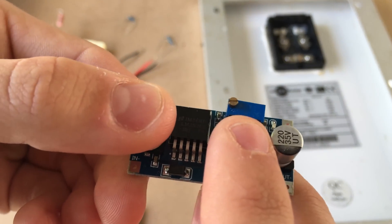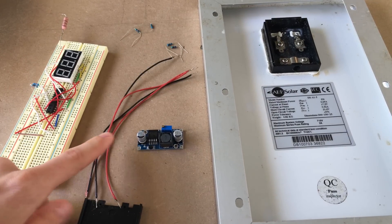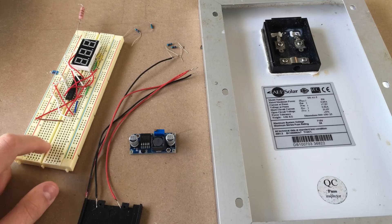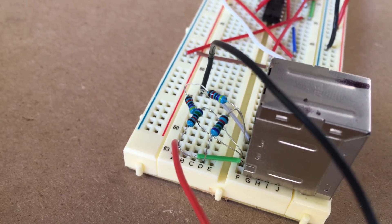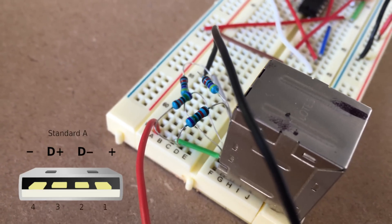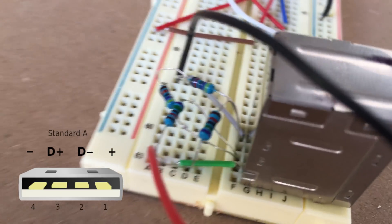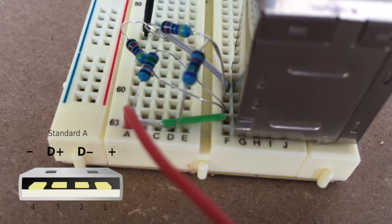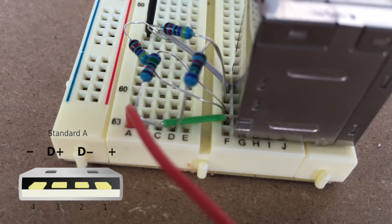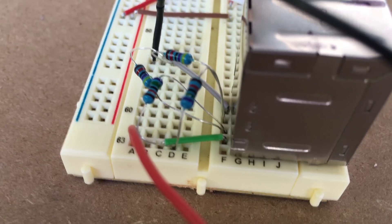We use a small flathead screwdriver to turn that little brass knob, and that adjusts the output voltage. First, let's use these wires, this buck converter, and this breadboard to prototype our circuit. When you're done, everything should look something like this. You start with the input wires coming from the power rails on the breadboard, going into the buck converter. From the buck converter, the output goes to the left pin and the right pin of the USB port — that's just the positive and the negative. We've got the resistor dividers going to the center pins, which are the data positive and data minus, and this tells the phone what current to charge with. I'm posting a schematic in the description as well as one on the Instructable.